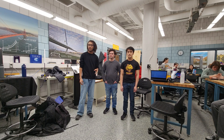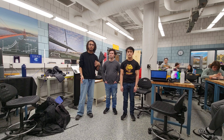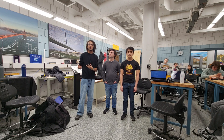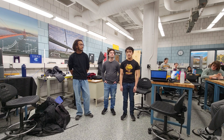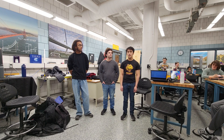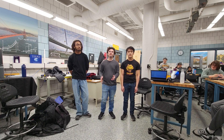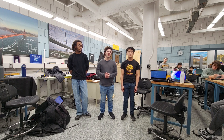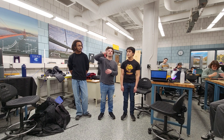Today the first thing we were working on was Pathfinder. It took a little while to get the mecanum drive working with Pathfinder and everything configured, but now we can drop all our paths and schedule all our commands as needed with Pathfinder. Another thing we've done today was alignment with AprilTags — the robot is able to align pretty well and follows them pretty well. We've also spent a lot of time improving all of our subsystem code and adding new features, such as software limits for the intake pivot and the pivot arm on top of the elevator, so that we don't overextend these subsystems.